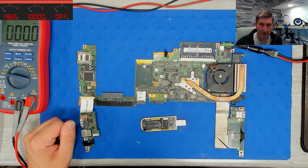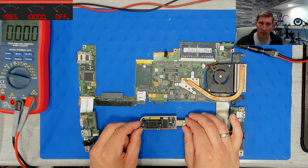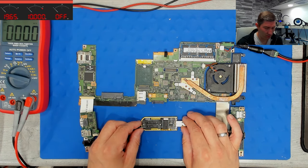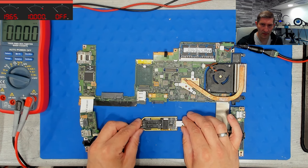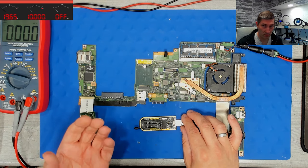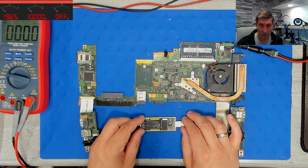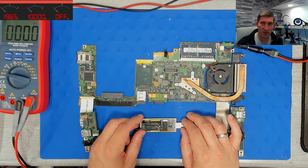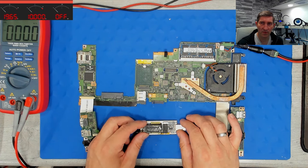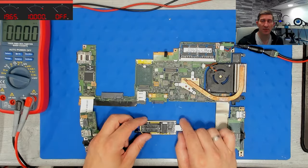The volt mod. Let's talk a few seconds about the volt mod. The CH341A with the black PCB is known to have a design issue. If I remember correctly, the data lines are fed from 5 volts instead of 3.3 volts, which can cause issues and in the worst case damage the chip or the board if you try to program in circuit. So some smart people found a way to step down these voltages, the 5 volts to 3.3, by improving the circuit of the CH341A. Let us check under the microscope.